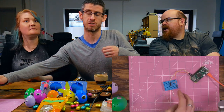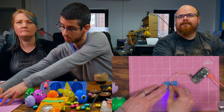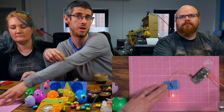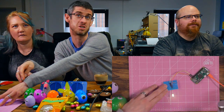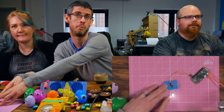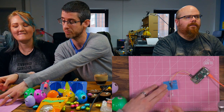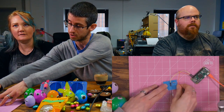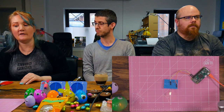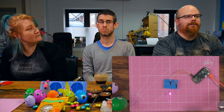And we've got a resistor there at the moment. But if we just totally bypass that resistor, you can see it still works quite happily. We left it running for a good 20 minutes and it was fine. That's because they've got a chip inside to do the rainbow colours. So they're quite happy on 3.3 or 5 or anywhere in between. And if you do make a throwie out of them, it lasted 9 days before it became not bright enough to see. Still going though.